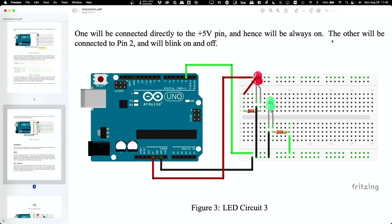And, okay, so, let's try that. Okay, here, let's try this instead. I'm just going to download it instead of copying and pasting. So let's download that and then actually open it with the Arduino software. It'll make a folder. Okay, and then now the formatting got all messed up. Okay, so we're connecting to an Arduino Uno on port 3. You'll see some blinking happening there as it transfers the program, and now it's done. So when you finish wiring up that other light, that one should blink on and off. Okay? All right, thank you.